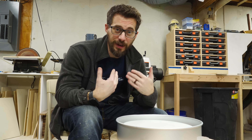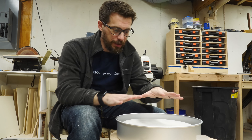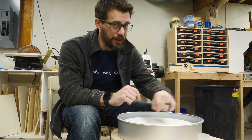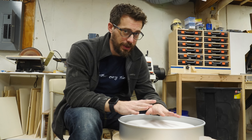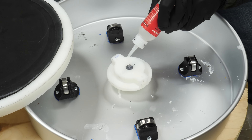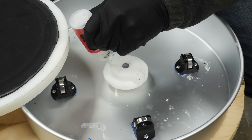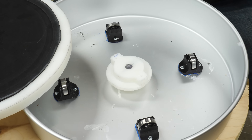We've got the new bearings in place. We did a test — it runs great, and it's so much quieter. That's full speed and I don't even have to raise my voice. It's so much better. We also had to play a little bit with it to get the top true, but once we got it true it's staying where we want it, so we're going to take it off again. Instead of epoxy, we're actually going to put a little bit of CA glue, because I don't know how permanent the epoxy would be, and I'm not entirely sure we even need to glue it in place — so if we ever need to break it off to re-level it, it should be pretty easy to do with this stuff.